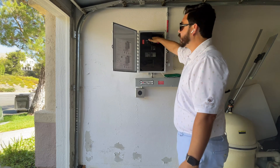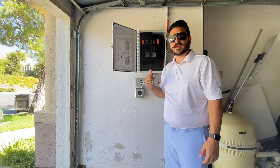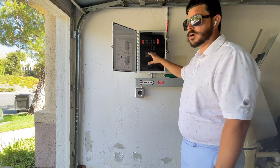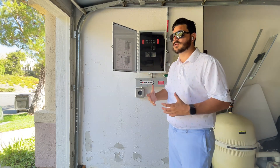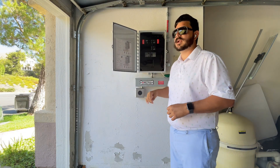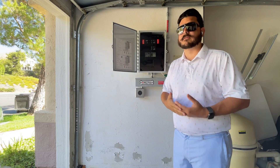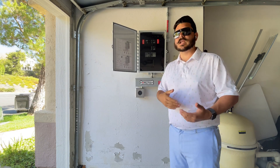If you don't have any lights on in here, then we're going to want to go look at your electrical panel. This can be said also with your string inverter. If you have SolarEdge, SMA, or a Fronius inverter, and you see a red light, whatever type of string inverter you have, they should have a red light to indicate there's a fault.